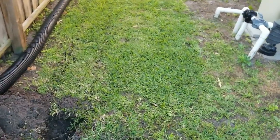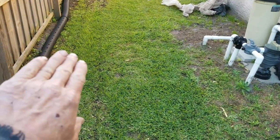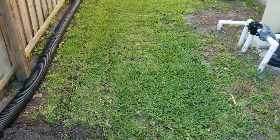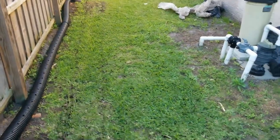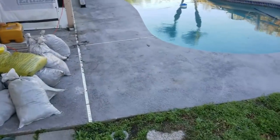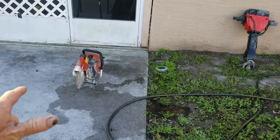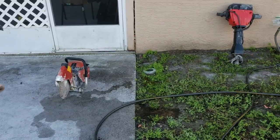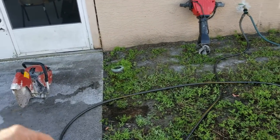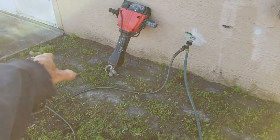In addition, we're going to put in some French drains along this side because, from the grade, this water just sits here from both homes and floods pretty badly. During the hurricane she had a real flood come inside the house through this area, and that's what prompted doing all this work. So in addition to removing this concrete and putting the channel drain in, you can see we've got our jackhammer ready — the channel drain will discharge in this direction and come across.